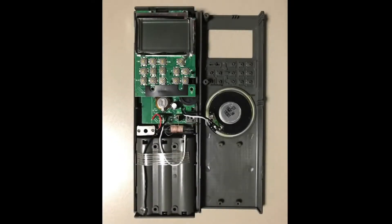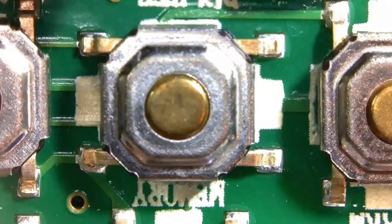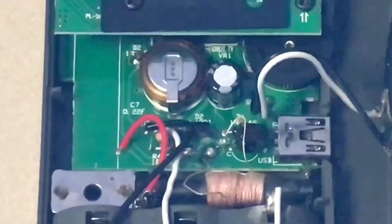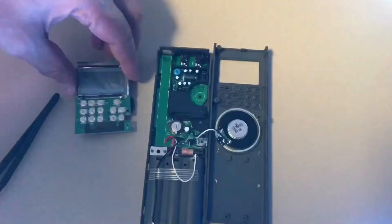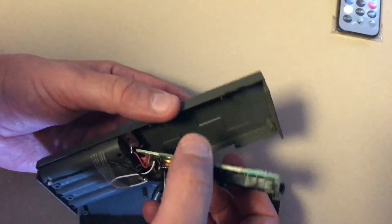Already a nice surprise — I didn't really expect these individual microswitch assemblies for the buttons, reminiscent of something more expensive. I've got a pretty good idea what to expect for the rest of the way though, because they make it pretty clear in the advertising material: it's a single-chip Silicon Labs radio IC, and they'll obviously need their own controller to talk to it, as well as an audio amplifier to drive the speaker or earphones.